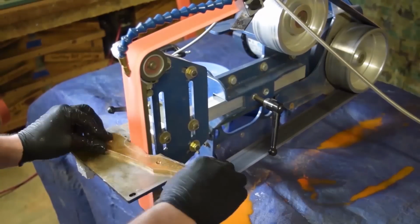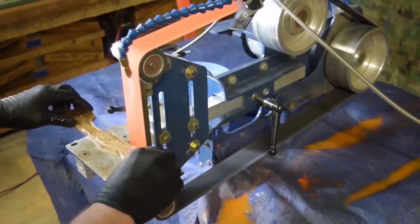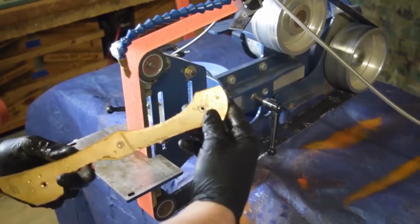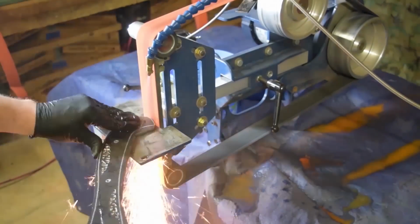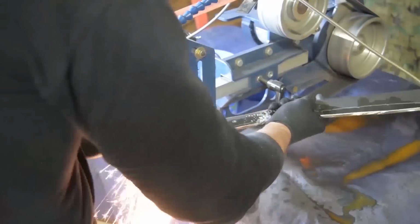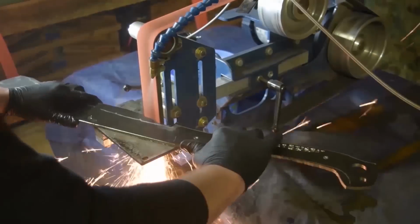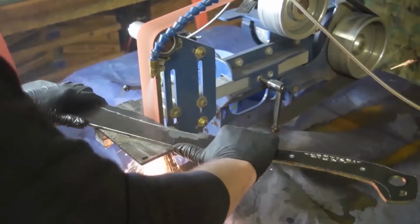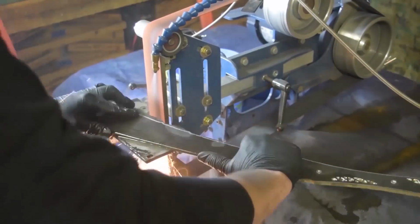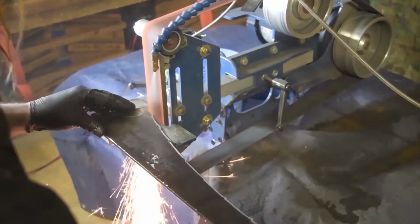And now I'll hop into those belts that I was talking about from Maritime. I used a total of 3 belts on this build. They're great belts. Like I said, I use 50 grit of the same Norton Blaze. But these 50 grits, man, do they chew through material. And the only reason I use 3 different belts is because I didn't want to, you'll see in a bit, do the grinds on the blade with the same one that I did profiling with. But yeah, profiling the handles and the blade itself all with the same belt, and it still has life to it. These belts are really, really good.